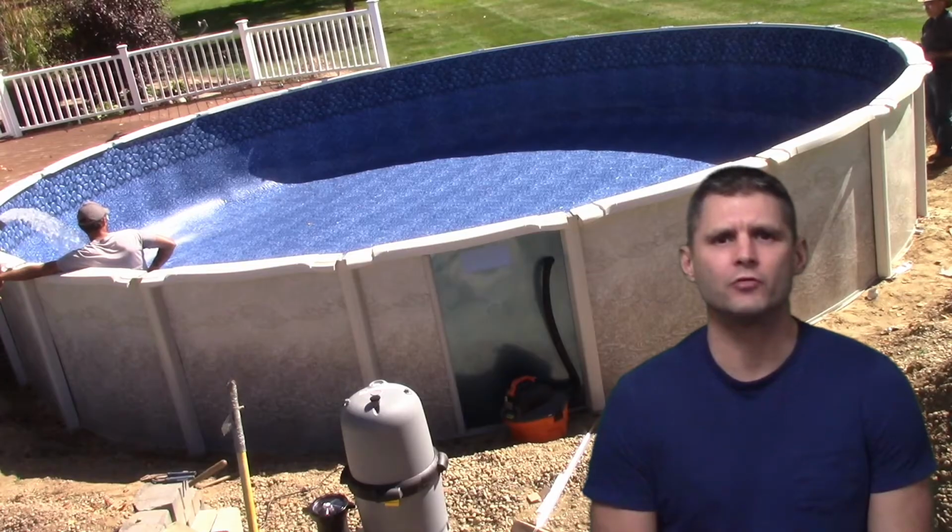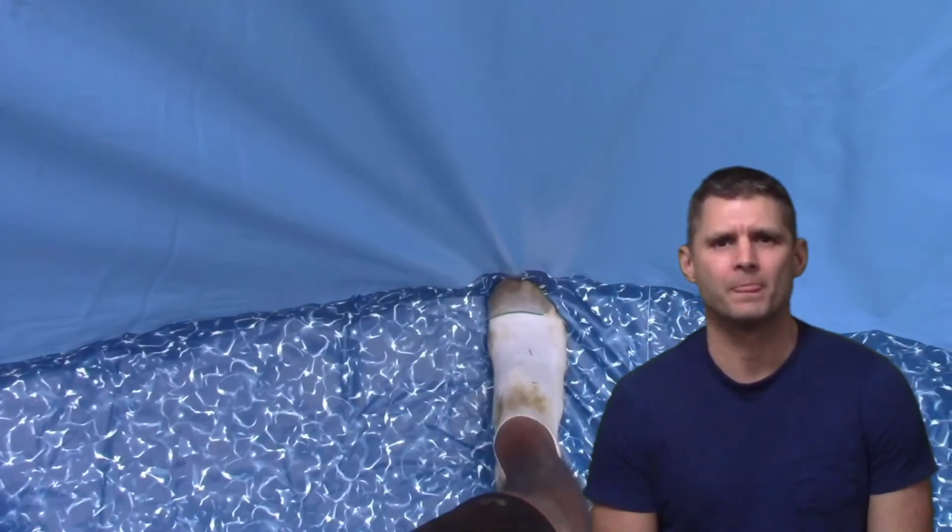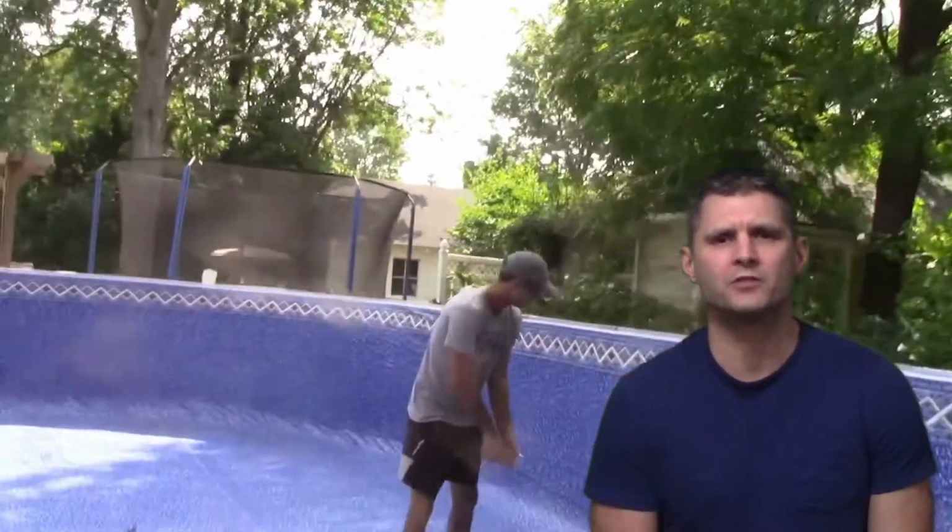The main seam travels around the bottom of the pool at the sand cove. Most seam separations occur almost immediately when being filled up. When you see evidence of a seam separation, it will generally be obvious, with a lot of water coming from underneath the pool. It is not meant to be mistaken for a little bit of moisture. A little bit of moisture may just be from the weight of the pool water pushing out the water in the saturated sand, or simple condensation.